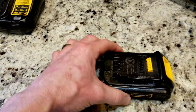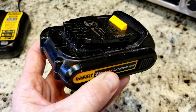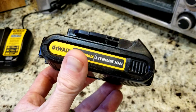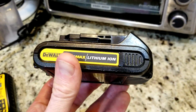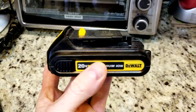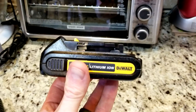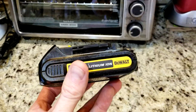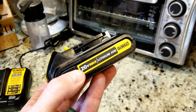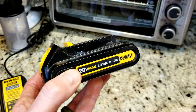It's not your charger's problem — it's the battery. Unfortunately, probably one cell in here has been corrupted, causing the entire battery not to work. A lot of people are scrapping these for electric bikes or building their own battery packs. You can actually resell a dead battery — this particular DeWalt DCB207 is going for $15 to $16 as a dead battery. This is repairable if you know what you're doing, but you'll need to solder in or spot weld a new 18650 cell.